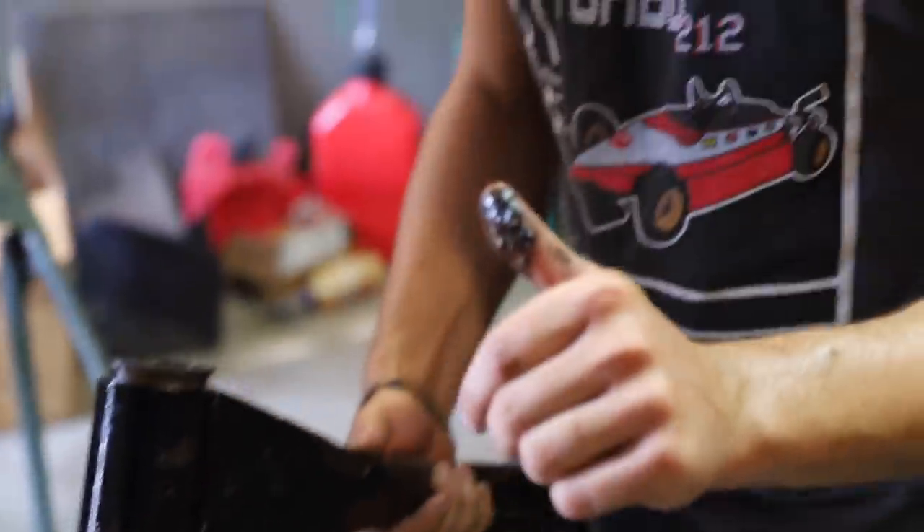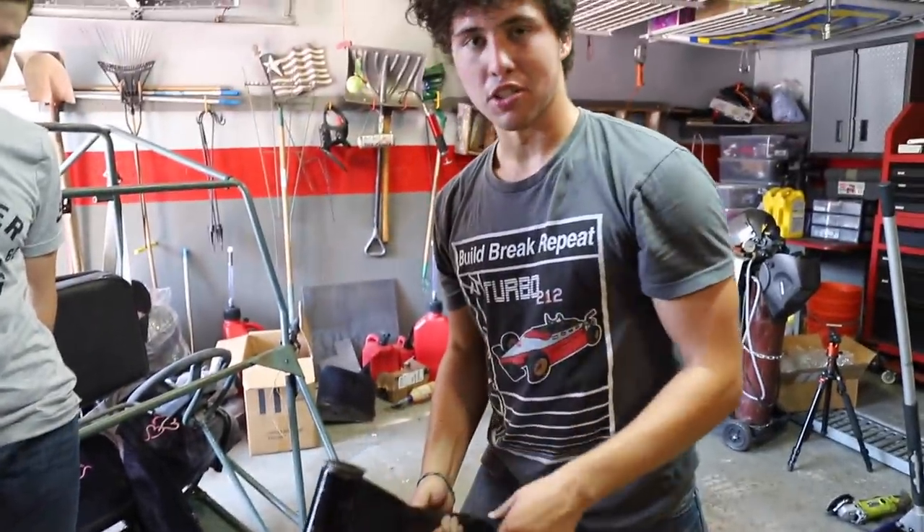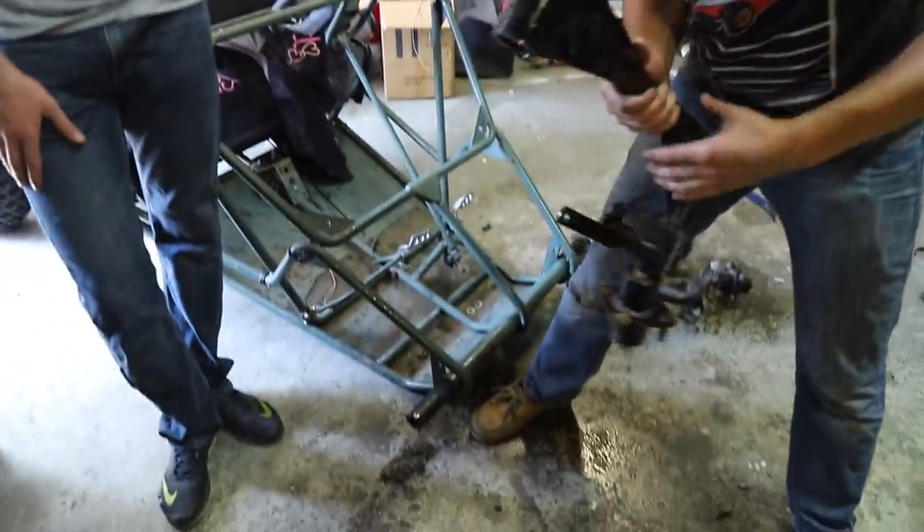This is nasty — all just metal shavings and debris from years of use. The bushings are actually in really good shape though. We're going to clean out the bushings, they don't even need to come out. Sand all the rust off and then we can put it back on and we're going to have a really good suspension.